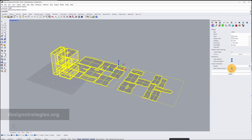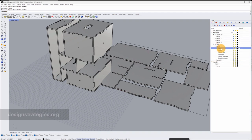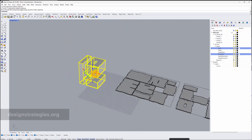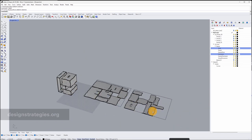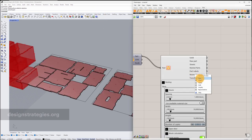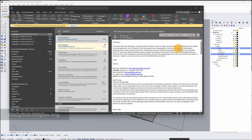I close Grasshopper and look at all the elements. I select everything and switch off ISO curves to see it better. I look at my baked solid and labeled parts. I select all objects from the solid and label part layers and move them to the right to inspect them properly. The design looks really good — I think it's ready for production. I notice I forgot the labels for the unfolds, so I go back, bake the nested parts as nested label parts. Now this is also fixed.